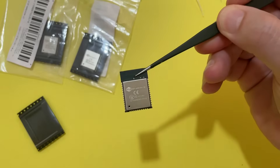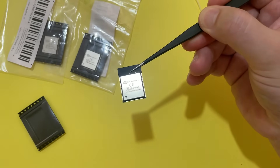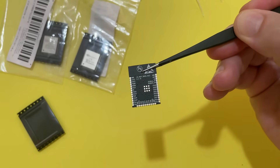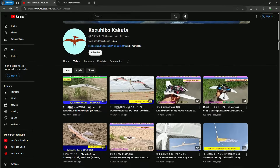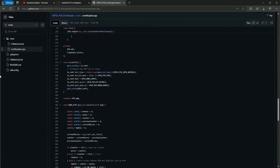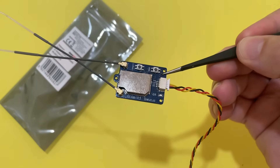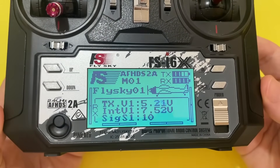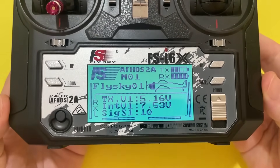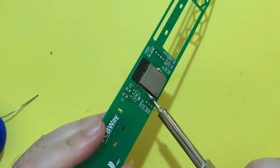Regarding the electronics, I'm using an ESP32 module, which is not really a ready-to-use solution, so a PCB to mount this microcontroller is essential. I want to give credit to an ornithropterist who inspired my work — I modified his Arduino code to run on the ESP32 with FreeRTOS. The last thing I want to mention before the build is this three-wire FlySky radio receiver. This PPM receiver also sends telemetry data to the radio controller, allowing us to monitor the battery voltage directly.